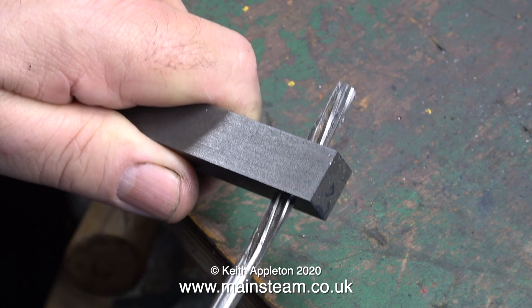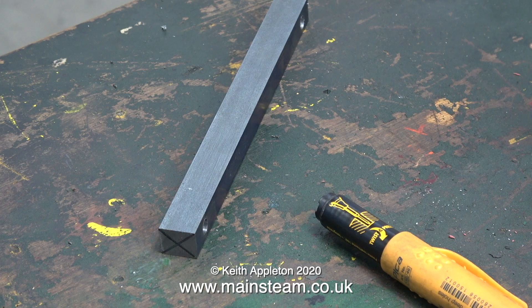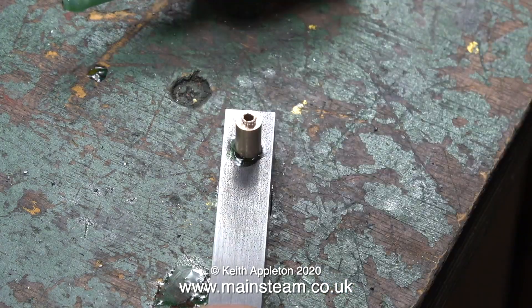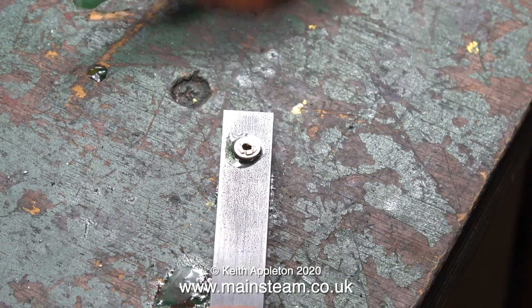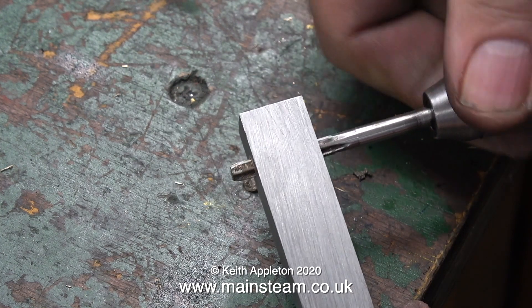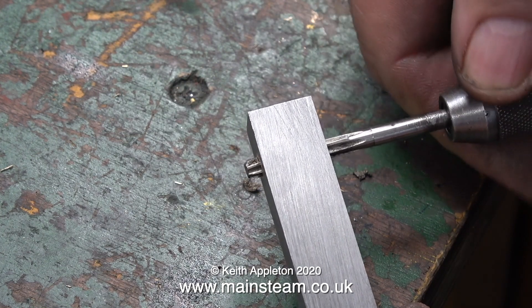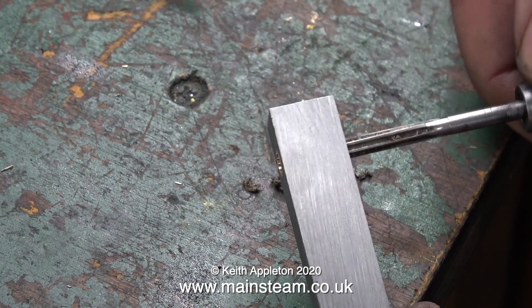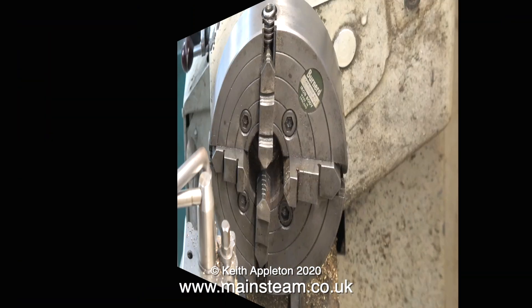A hand reamer has a slight taper, so I finish off the reaming job by hand at the bench. Even though I'm only showing one side, I do it at both ends of the piece of bar. On one end of the piece of bar I draw a cross with a felt tip pen — you'll see why in the next episode, but for the moment the cross is just telling me that this is the forked end. I covered the making of the leaded bronze bushes successfully in part 28, and with the help of some Loctite 603 I'm tapping the bushes into place. Once I've fitted both bushes, I made them flush with the steel bar using my four-inch belt sander.